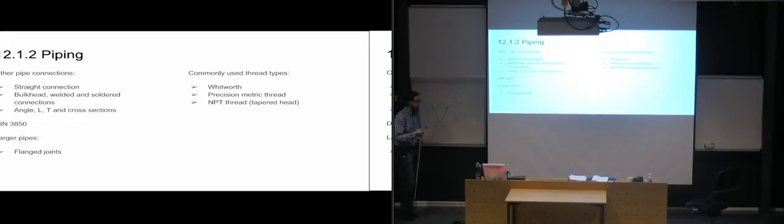The same is if we have, what's it called? Unified threads is the name for it, but in other words, instead of being measured in millimeters, they're measured in inches. So that's basically most of the difference. So they have inches instead, but they're still using the 60 degrees. So if you match up the correct bolt in inches, you can use a nut in millimeters, and it's going to fit, so long as you find the correct match with the diameters, because they have the same angle between the threads.